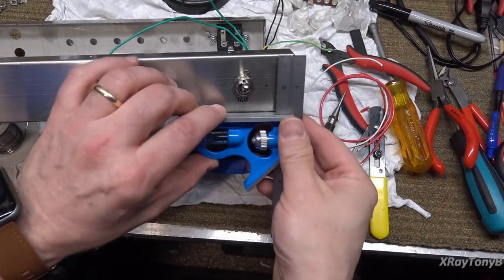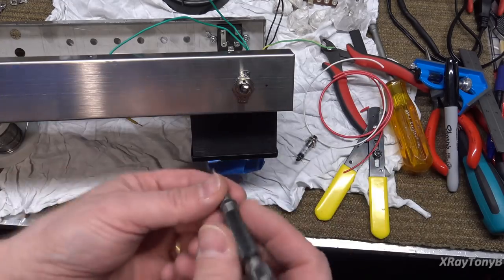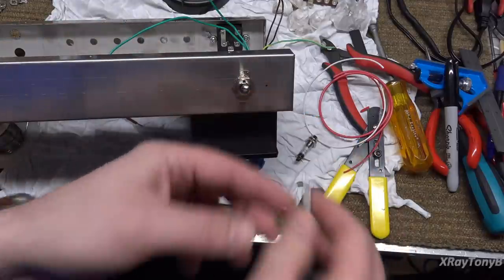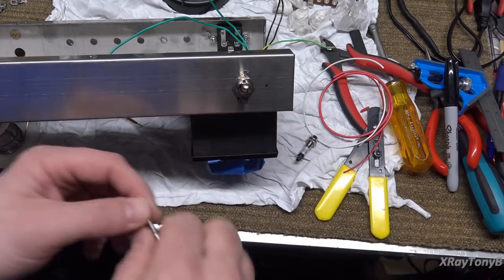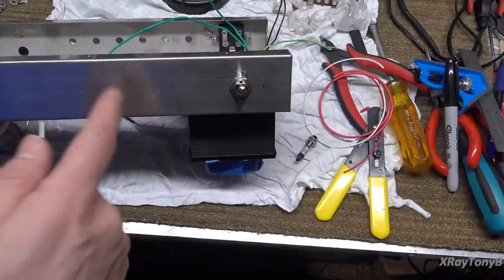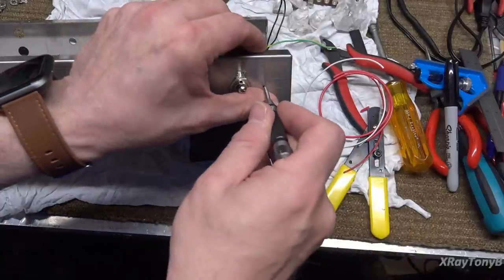I've taken my little square, measured roughly halfway, and put a little felt tip mark there. I'm going to use this spring-loaded center punch — these are pretty cool. They pop a little indent in there so your drill bit has something to purchase on when drilling, because if you try to drill right on your mark the bit tends to want to dance around, especially if this is truly stainless steel.